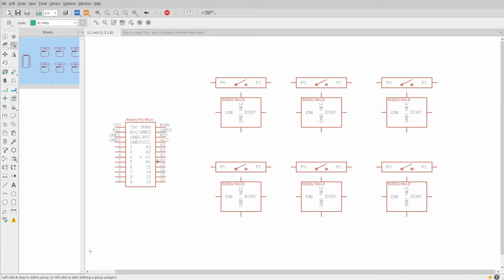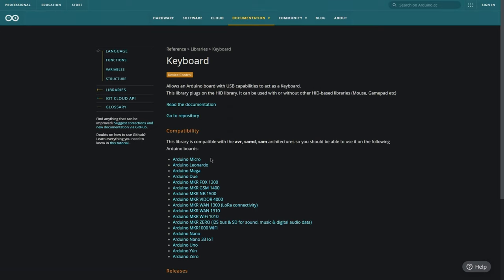I've already placed a couple of components in here. Here we can see the Arduino Pro Micro that we are going to use. The reason we're using a Pro Micro is that the microcontroller on it is an ATmega32U4, which has an integrated USB controller — it has directly two pins that are the USB out, giving you more control. For example, on the Arduino Nano or Uno the microcontroller and USB controller are separate. Other Arduinos with the ATmega32U4 include the Leonardo and the Arduino Micro — the Pro Micro is just the smaller version.